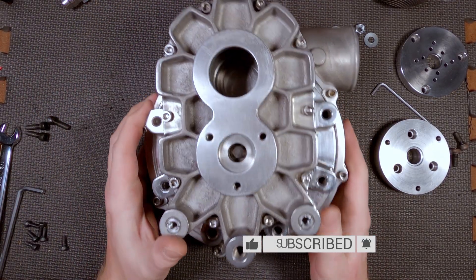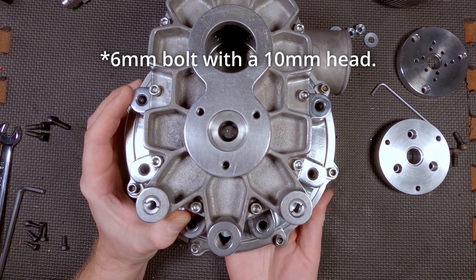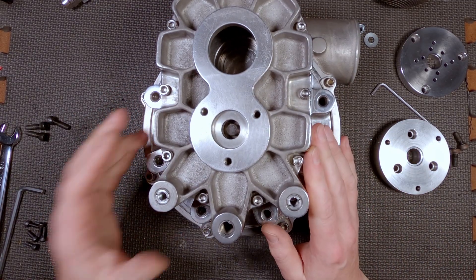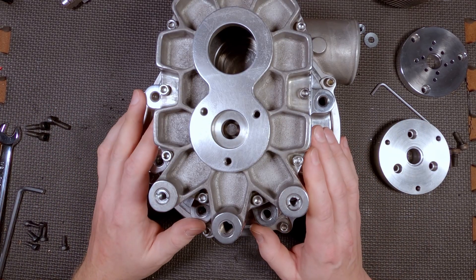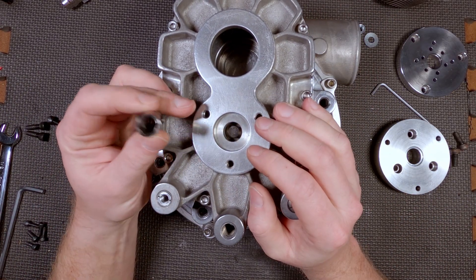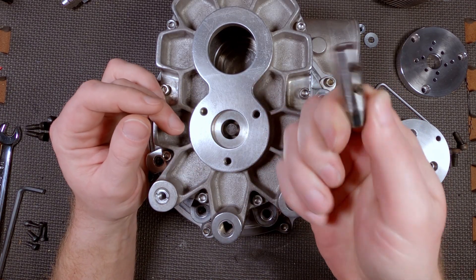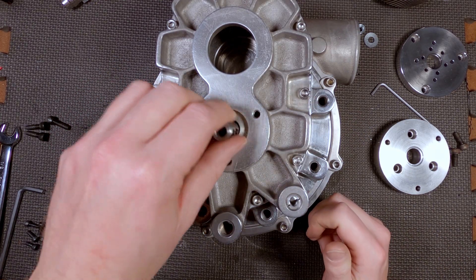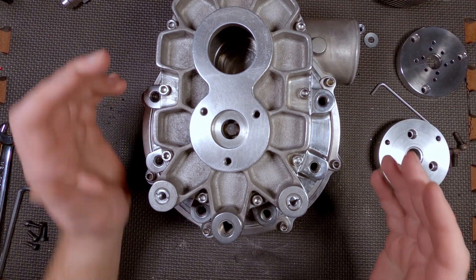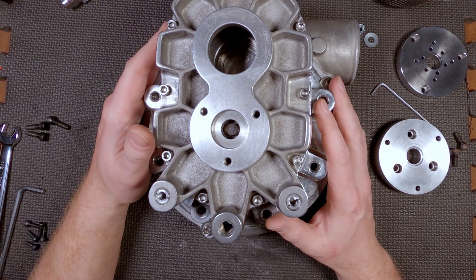The input shaft used to be up here. You can see a 10 millimeter bolt - that's what drives it. That's threaded right into the back of the impeller shaft. The wave washers are in there. They're angular contact bearings. That's how the drive works. And incidentally, this is the drive from version one. It's just a modified hex socket that I turned down in a lathe, TIG welded on, a steel slug in the back, a couple of set screws. It just engages this and drives it. It turns out this is the most reliable drive so far. I made it purely out of convenience and to allow for some misalignment, but it's worked better than anything else so far.